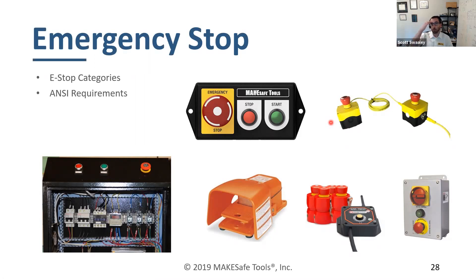For example, if you're a lumber company and you're using large band saws and you're often re-sawing, chances are there's someone on the feed side and someone on the other side. The person holding and supporting material doesn't necessarily have access to turning that machine off, so if something goes wrong, they're helpless. That's an easy case for just putting another series e-stop on the other side of the machine. It probably costs you $50 and you significantly reduce the chance of a hazard getting really bad. And our product also does e-stop.